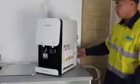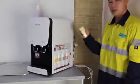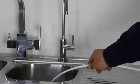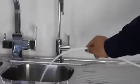Step 4. Open the filter compartment. You will find a bag of quick connection joiners and clips for the filter's connection. Let's start to connect and flush the filters one by one. Before continuing, cut another PE tube in adequate length to discard the waste water from the filters.